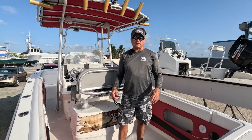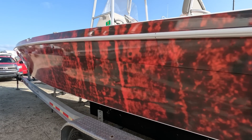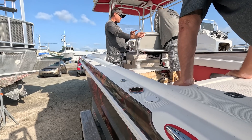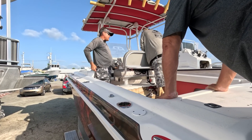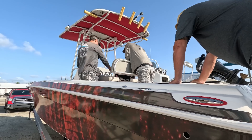The only reason we're doing this is because the clients don't want to spend any more money on the boat. We're doing it for a quick repair so they can use the boat in a parade coming up. Wipe down the bottom, take the Sharpie, then put tape on the marker. Use 5200 — put it down, get it in place, and stand on it. Make sure it's all down, then move on to the side ones.